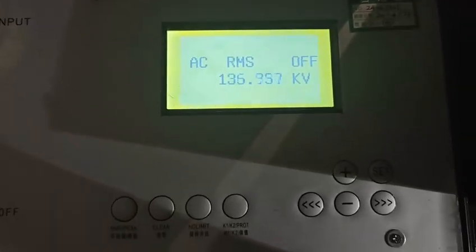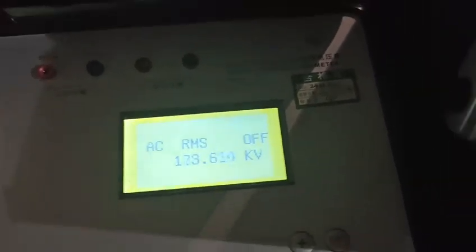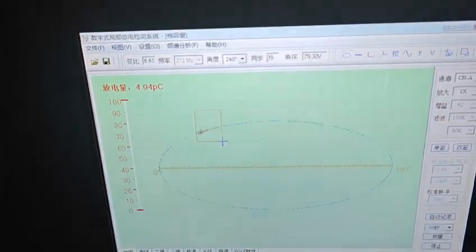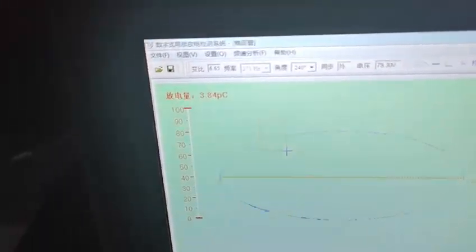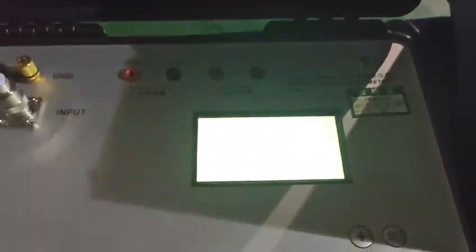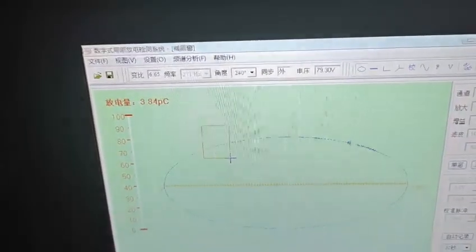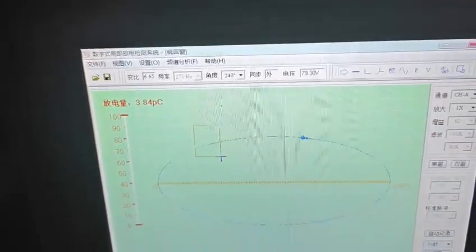You can see it has increased. The picocoulomb level is very stable, almost close to zero. We are already up to 250 kV. The PD level is waiting — close to the background level.